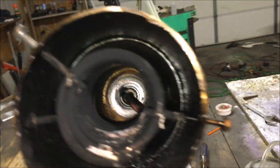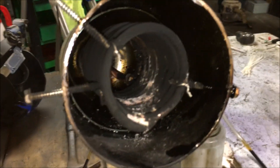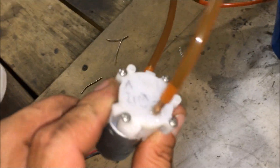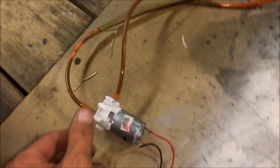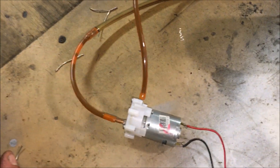I'm not sure waste oil can produce a blue flame regardless of how much oxygen you mix into it. At any rate, the blower used on this came out of a Stanley wet vac from Walmart. Here is the pump that was used to drive the device — a 12-volt pump salvaged out of a Swiffer Wet Jet mop. So if you're ever hard up for a high-pressure gear pump, grab a Swiffer out of the trash because it has one of these inside. This is a fairly pricey little piece of equipment if you were to buy it by itself — you can almost buy a whole Swiffer Wet Jet for what this pump costs online. But the pump worked very effectively.